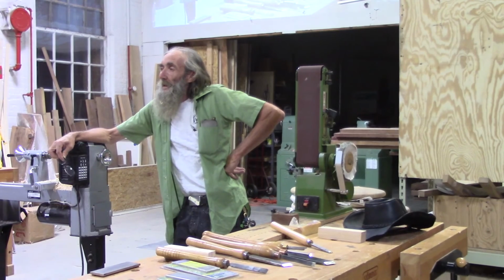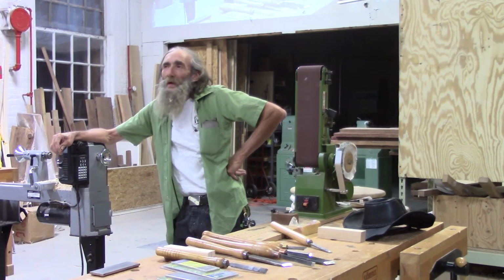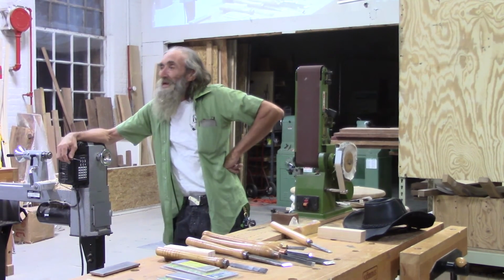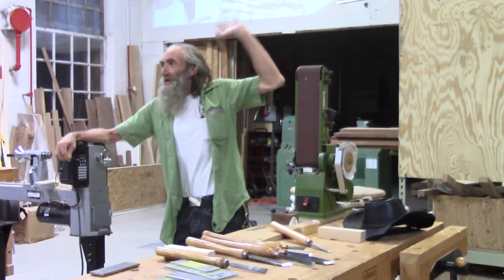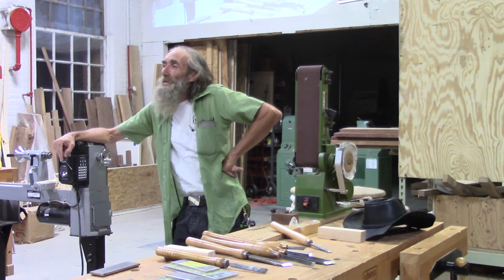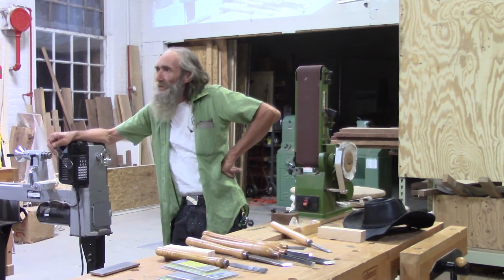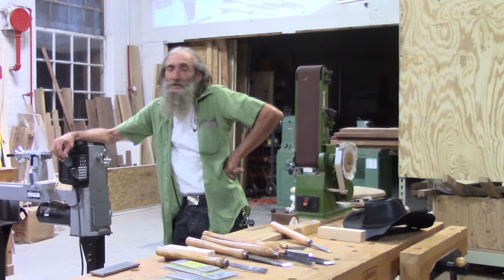What's the difference versus a grinding wheel with the one-way setup? Okay, if you're talking a one-way skew setup with a double-off bevel, anybody who owns it wasted your money, myself included. No, I mean the one-way that you use on a regular grinder, that you preset, for bowl gouges, et cetera. For the bowl gouge, like I said, I do that on the grinder, but not with a skew. For a skew, the best way to do it on a grinder is basically freehand to get your bevel, as far as I'm concerned.